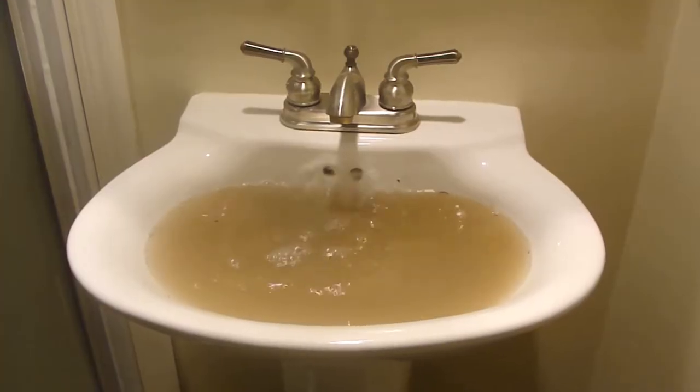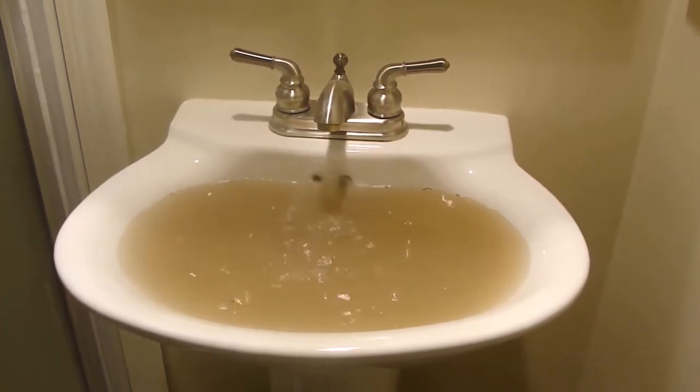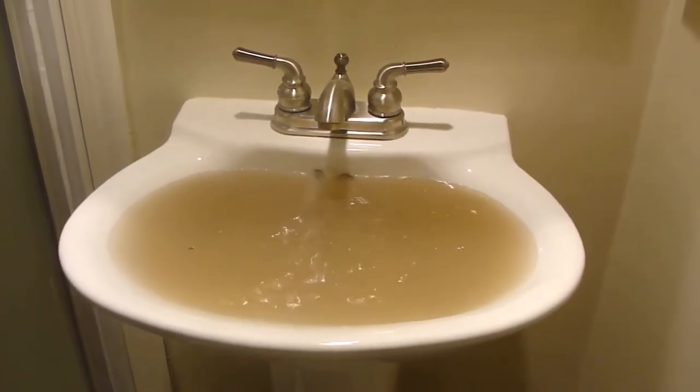It's not that you have a problem with the floor drain; it just happens to be the lowest fixture. I had a good example of that once where there was a house that had a problem with the main drain line — it didn't have a floor drain, but when I came downstairs to the basement bathroom I saw black gunk in the sink bowl that wasn't there when I first went through the house. I filled up the bathtub upstairs, drained it, came downstairs, and witnessed all that water backing up into the sink bowl — simply because they had a clog in the main line. If there was a floor drain, water would have backed up out of the floor drain, but there wasn't, so it just backed out of the lowest plumbing fixture, which was the sink. That's why water backs up out of floor drains — it's not a problem with your floor drain.